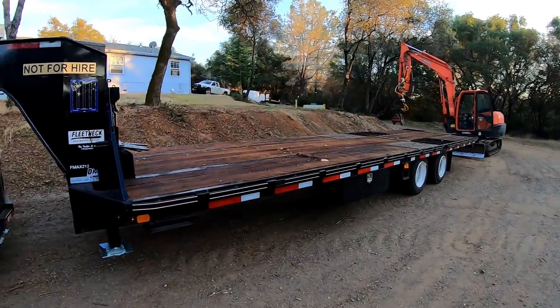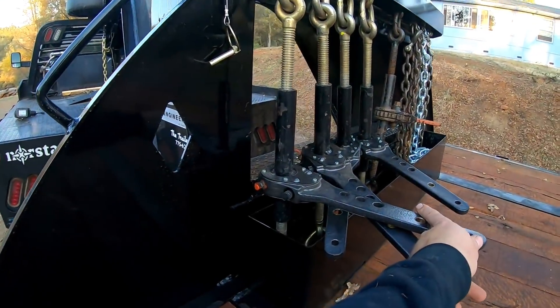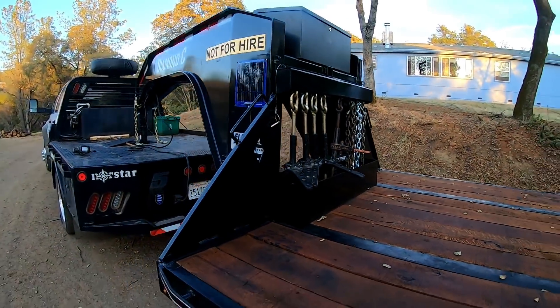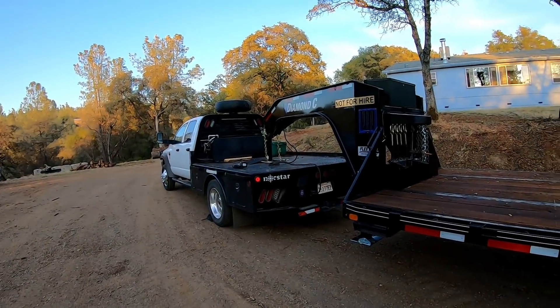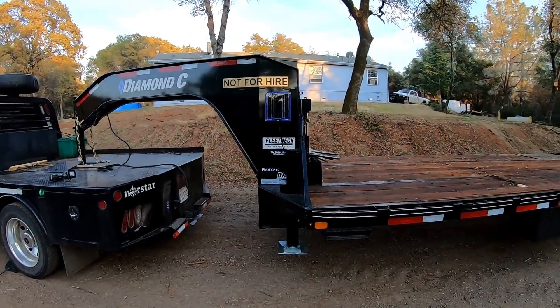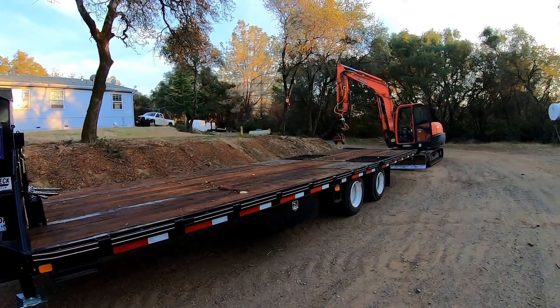The word is: this new setup was pretty much effortless. People keep asking about the speed binders — I've been hauling with them for a couple of weeks now, every load on this new trailer, and I'm definitely very happy with them. As long as you've got a good charge on your drill gun so they get nice and tight, you've got no worries. That said, no matter what kind of binder you have, you should definitely pull over and check that everything's still tight and secure at some point in your journey. Load settles, stuff shifts — it happens even for the best.